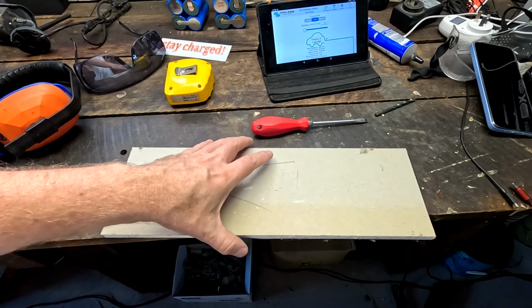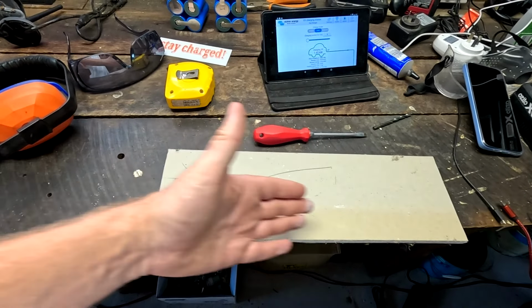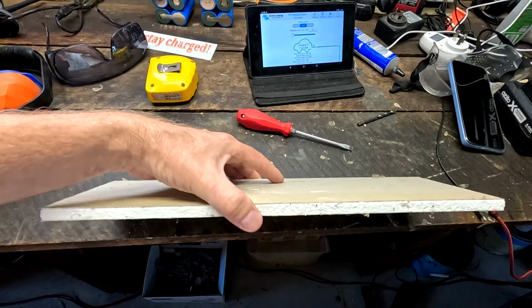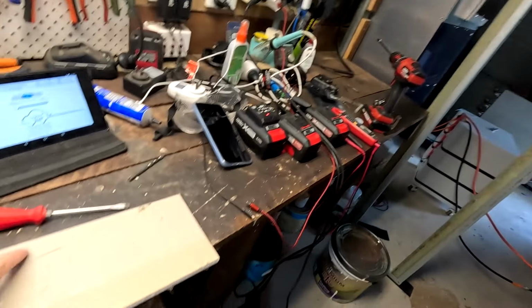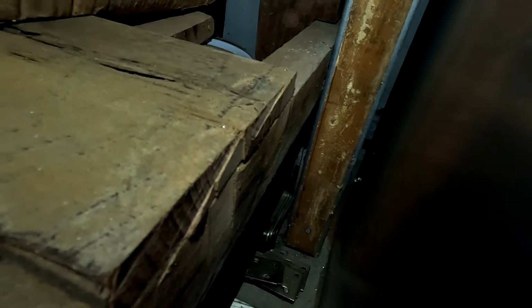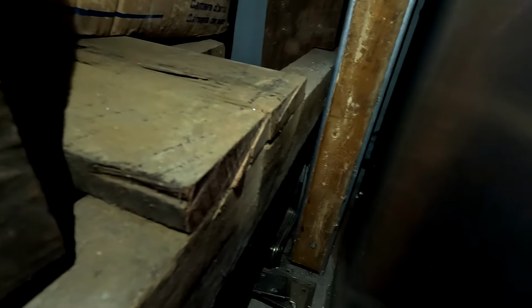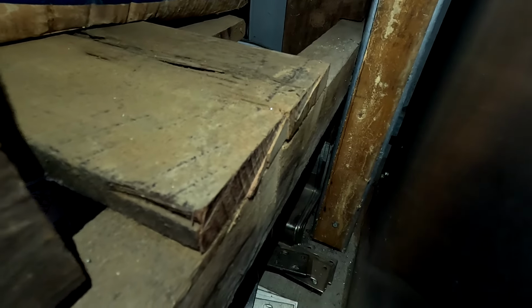Man, I tell you what, I'm so proud of myself that I'm the keeper. Yeah, I kept this small piece of plasterboard here. So I can cut this in half now, and then we can try it over there at the front door. To actually make enough space here, I had to cut off my shelf a little bit here in the bottom, as well as here at the top bench. And because this is also narrow here, I couldn't use the jigsaw, so I had to hand cut it with the hacksaw. It took forever.